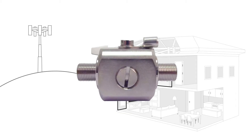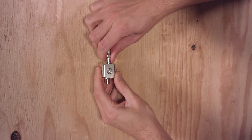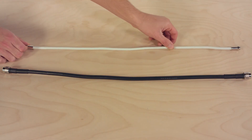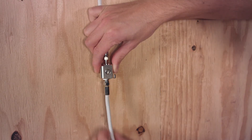To install a lightning surge protector, follow these steps. Install the lightning surge protector close to the outside or external antenna. Attach a cable from the outside antenna to the surge protector — you can purchase short two-foot cables for this purpose.